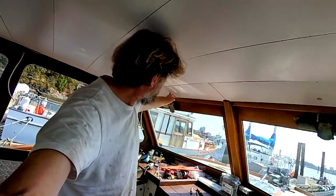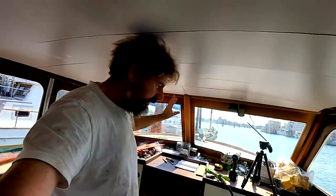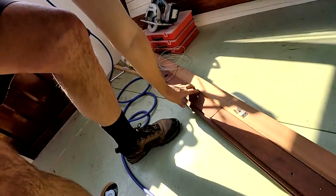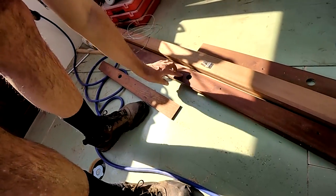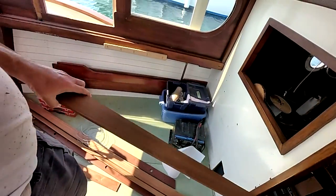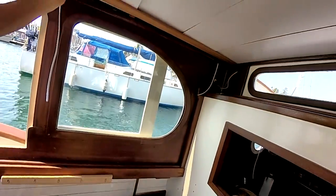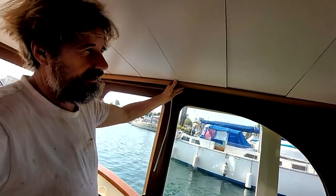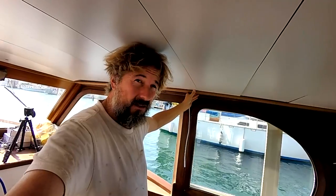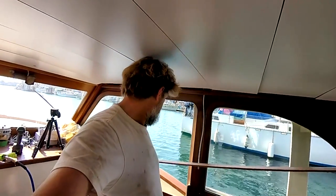With those two pieces up — they're only temporarily tacked, that's why they're not properly aligned yet — I have to bring them down to do the wiring and decide exactly how I'm going to do that, because they're going to be integrated with the lighting in these strips along the side. They're going to look a lot like that one from my boat, which I'm refinishing. I'm going to take some more of this beautiful 3-inch by 3/8 Sapele Mahogany and make some more strips. The wood is just over 8 feet — just long enough to make that strip perfectly.